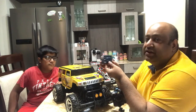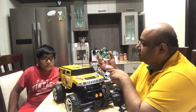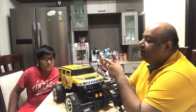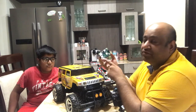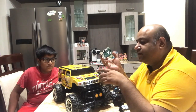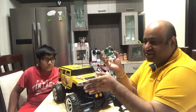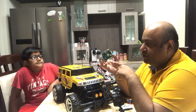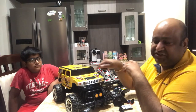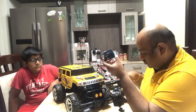We will use a Raspberry Pi board, which has a microprocessor on it — it's almost a full computer. We can use this for advanced communication with a laptop that will do the processing of all the data the vehicle captures. That computer will also send instructions back to the vehicle based on what the camera mounted inside is seeing.